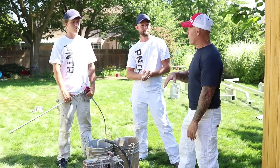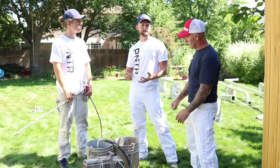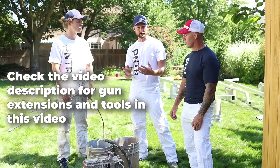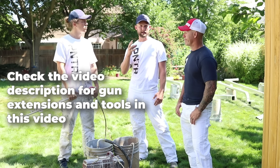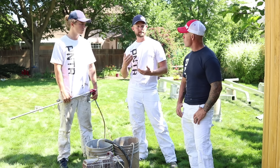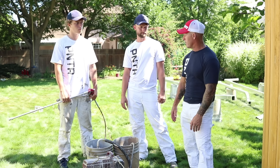There you have it — how to operate an airless sprayer. A couple of the most important things: make sure you've got the buckets, that's pretty key. Where we see guys make mistakes is not running enough product through when they're priming or bringing paint to the gun — you've got to run it 10 to 20 seconds so there's no air in the line. Make sure your pressure is set where you need it. The air in the line is going to create spits or clogs, so especially using an extension you're going to get big spits and an erratic spray pattern. If your paint has debris, it's not going to have enough pressure to push through the filter. Having air inside the pump is going to give you a lot worse spits.